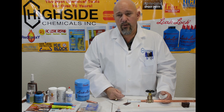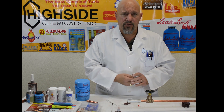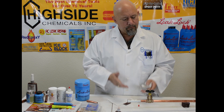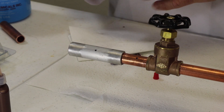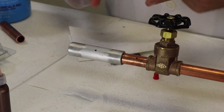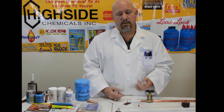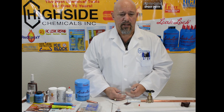When you're using aluminum, you might want to give it just a couple of extra minutes to set. But in just a few seconds that bonding process is going to start, and you can continue on with your work. This is a permanent repair — not temporary. Good to 1,200 PSI and 250 degrees. Most materials most industries handle are well below 200 degrees, so you're going to be absolutely fine using this as an everyday application, not just a specialized one.